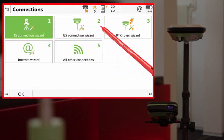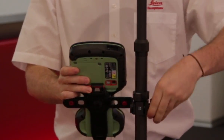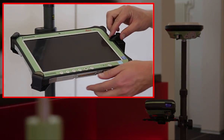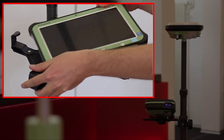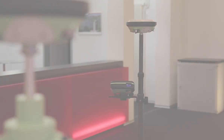Of course, if we have done this configuration previously, then all we need to do is turn on the equipment and we are ready to go. After completing our work for the day, we will want to remove the CS from the pole to store or transport it. For a CS20, we slide the locking bolt to the unlocked position, then push down on the controller and pull away from the plate to remove it. If using the CS35, we twist to undo the lock, lift the right-hand side out, and then pull the whole device from left to right. Now that we have seen what is held within a GS container and how to set up the equipment on both a tripod and a pole, we can bring this video to a close.